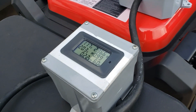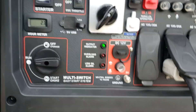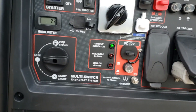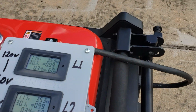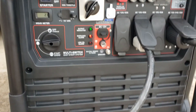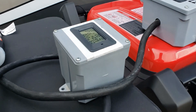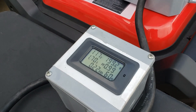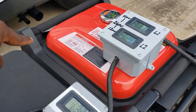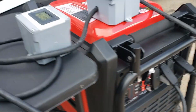It comes on right around there - let me back down. So at about 200 watts on the variac it seems like right around there is the threshold. Let's get that reading down to 190. So if you add 3.53 plus 3.53 plus 200 watts, the overload light comes on. That reading of 2.1 kilowatts - this is where the overload light comes on. Whatever that adds up to, that's your Predator 9500 max output wattage. Anything over that triggers the protection.